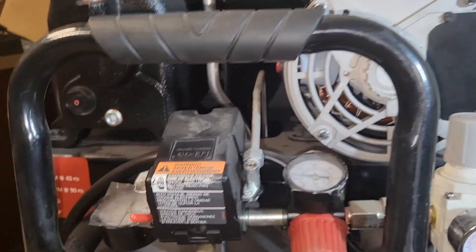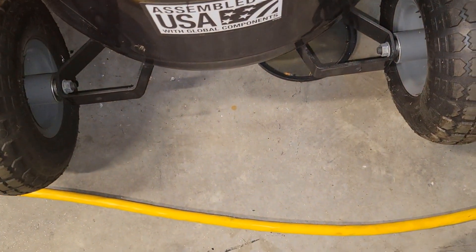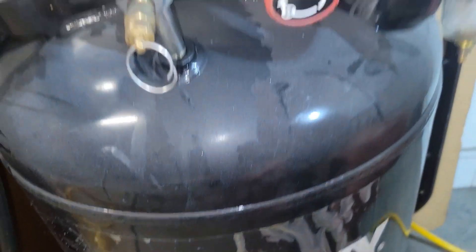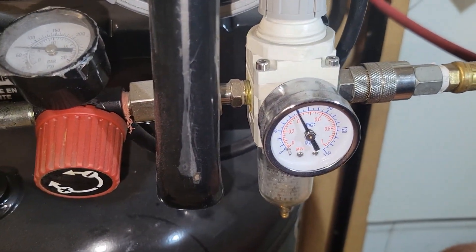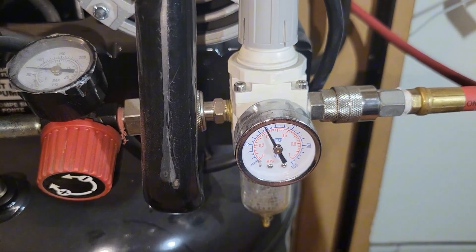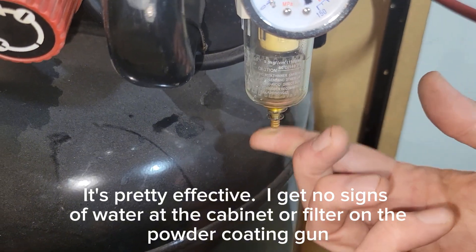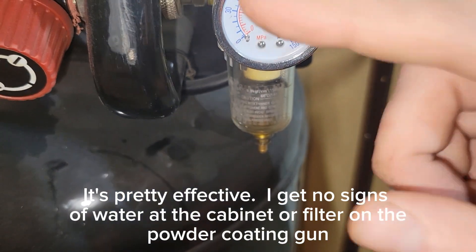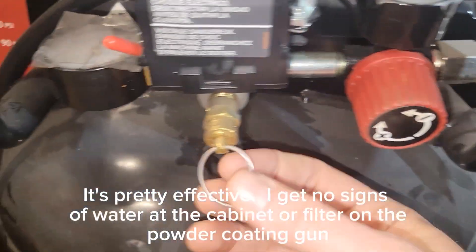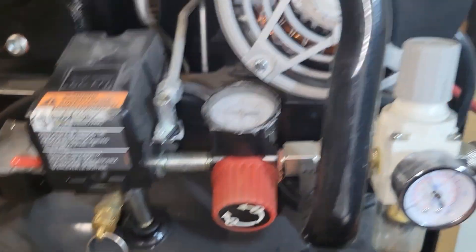You want something there that's going to catch condensation — you can already see condensation forming. Underneath is a little valve where you need to let the water out. I'll get maybe a quarter cup coming out of there and I'll drain it every couple of weeks depending on how much I'm using it. There's some liquid that comes out of this inline filter here as well — you can see the condensation. I went ahead and added an extra gauge. There's a quick connect right here. You want to get all the water out and make sure it doesn't go through your lines.